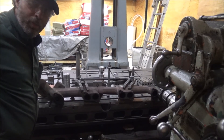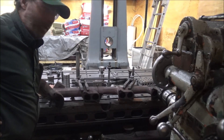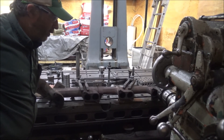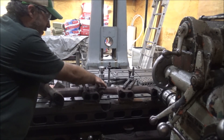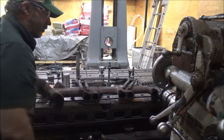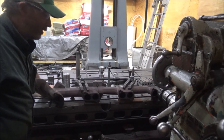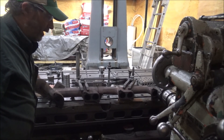Got a familiar job here but this one's a little different because the casting is a little different. Must have been a pattern change at some point in time. Maybe somebody decided that other version was too hard to hold so they fixed it. I've got this one set up here using the stop blocks because I've actually got a register I can push against. It appears to be further square. This thing looks close. I'll have to indicate it and check it, but you all don't need to see me do that. If you're watching this channel, more than likely you don't need to see that done.